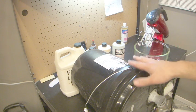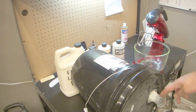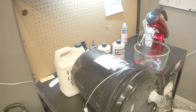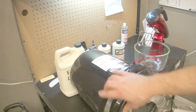You don't want to have it so that it's fighting to have airflow come back in to replace the previous foam latex liquid. Otherwise, you get a blub blub blub, and it'll cause you to miss the nozzle of your bottle. So always make sure that there's sort of half your nozzle empty on the top, so that it can flow predictably and easily into whatever receiver you're putting it into.